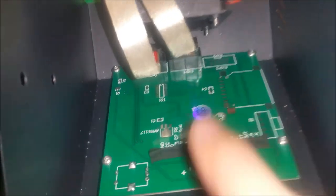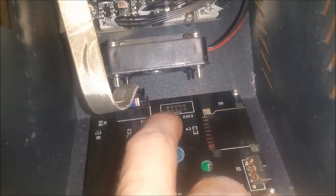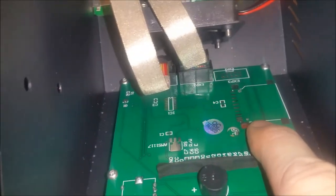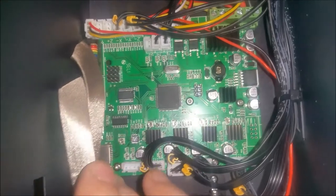There's a switch on the original that we're lacking on the CR10S. You'll notice on both of them we have pin-outs for a full SD card slot — that's where expansion number 2 comes into play. On the original it's not needed due to the fact that we have micro SD on the board. However on the CR10S, expansion number 2 does go to the board, though there's no SD card slot here. This is also the first time I've ever seen expansion number 3. The main board on the original is much smaller than on the CR10S.